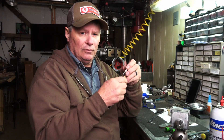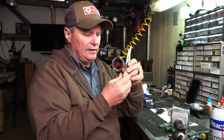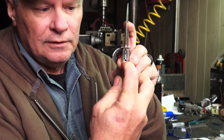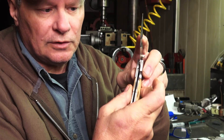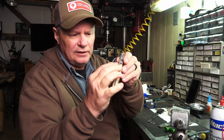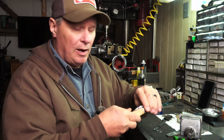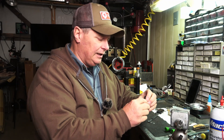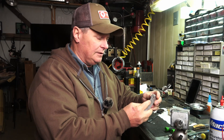Here on this old liner lock I've used — made this probably 30 years ago — when you push your liner over, it needs somewhere to go. So when your blade starts coming down, your detent ball is not putting a tremendous amount of pressure there, and you'll see a little gap there. This one here is a little heavy. Elliot Elamondo is the one who helped me learn how to taper them instead of just cutting the same depth all the way across. Great maker, Elliot Elamondo — you need to look him up. He makes very fine high-end liner locks.